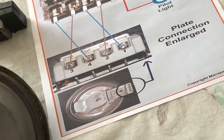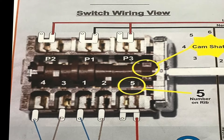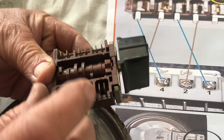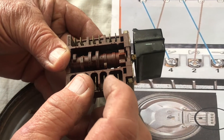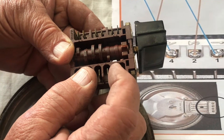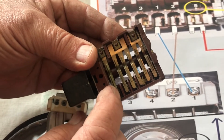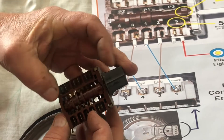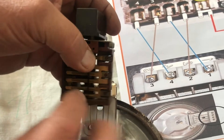The numbers are written there for the terminals on the plate — just like you see them here: three, four, two, one. You don't have to remember it, you just have to be able to read it. On the switch, on that plastic edging, they've actually printed numbers — five, two, one, three, four. If you zoom in along that rim you will see those numbers. Those numbers pertain to those terminals there. Turn it over and you'll find that two terminals actually come out onto one common point.